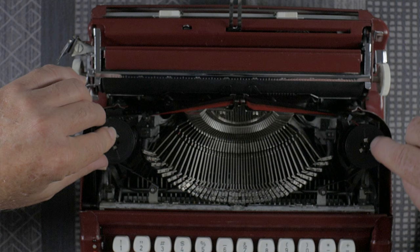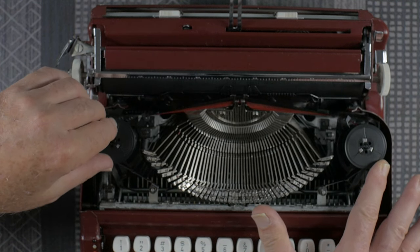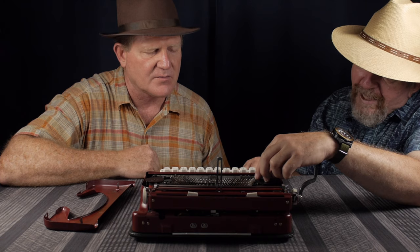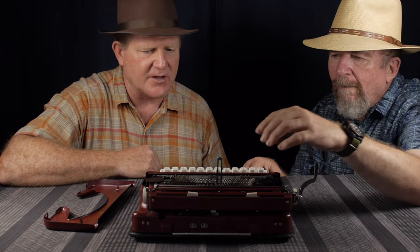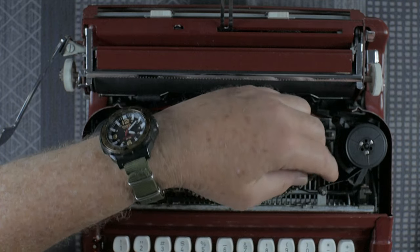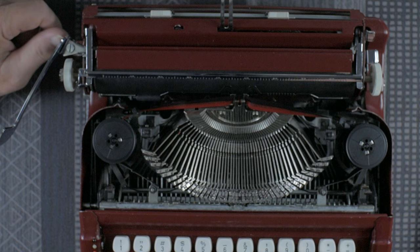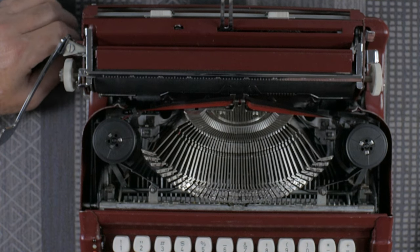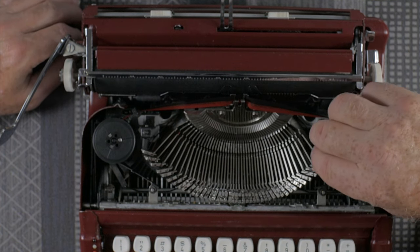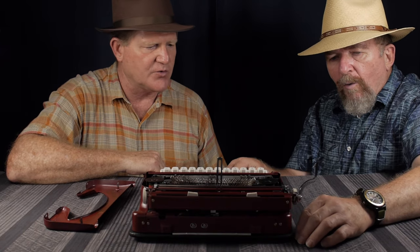The adding machine ribbons work really well in this typewriter. It has anti-backlash tension arms that keep a bit of back tension on the ribbon reel — a nice feature. The ribbon reverse is based on arm tension rather than an eyelet, so you wouldn't use an eyelet at all on this machine, which makes the adding machine ribbon even more appropriate. It's a standard PICA typeface and has the rubber tube style type bar rest. The machine was cleaned up and nicely oiled — just a real solid machine.